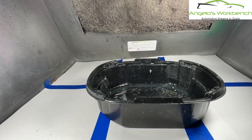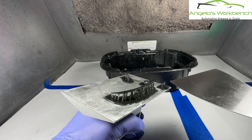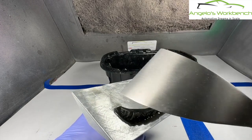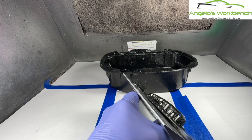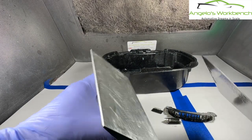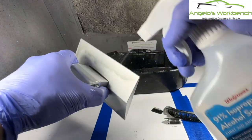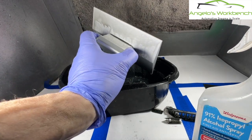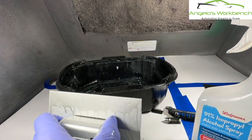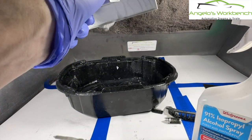Just as an example, here's what a 3D print looks like when it comes off the printer. This is the front spoiler, that rear light, and one of the headlight covers - the other headlight cover failed on this print, which happens sometimes; I probably need to change my FEP screen. You just pry these off - my 3D printer came with a little metal spatula. Then you need to clean everything off with some spray alcohol and just a wipe with paper towels. I use microfiber only on the FEP screen, but for metal parts paper towel is fine.